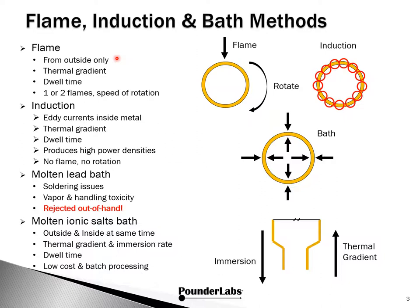We find there are three approaches to annealing cartridge cases. Gas flames have been used for annealing brass for quite some time. During manufacturing, this is very often done with gas-fired ovens when the entire sample is being annealed. After the cases have been formed for reloading, flames from propane, butane, and MAP torches are used. This is because we need a focused flame as we're only annealing from the neck down through the shoulder and top part of the body. With the gas torch, we heat from the outside, and the case may or may not be rotated while being heated.